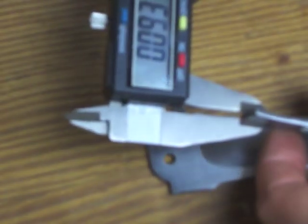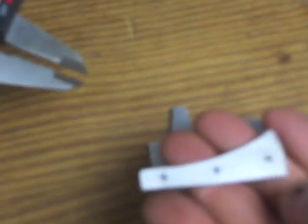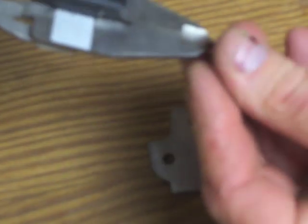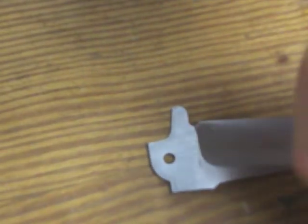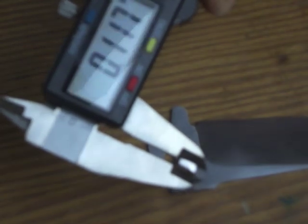And this is 3/32 01 tool steel. It's flat ground, it's precision ground. You can see it's 93 thousandths of an inch. And so what's going to happen is when I put washers on to the blade, here's two of the washers together, and once those washers are on the blade, the blade is actually going to be thicker than the backspacer. So as you can see, 16 thousandths, because each of my washers is 8 thousandths of an inch thick. And so my backspacer with the two washers is going to have to be thicker than the blade and the washers so that it's parallel.